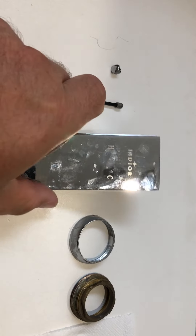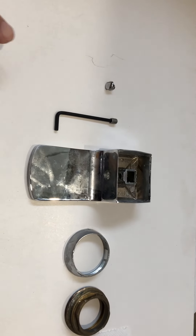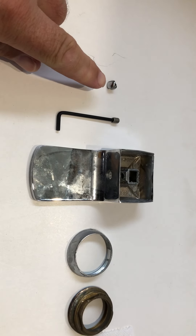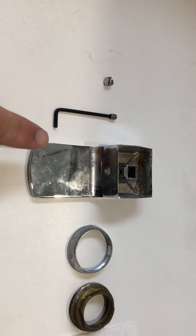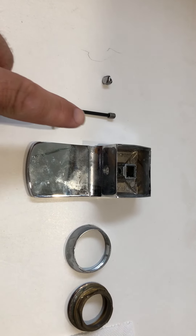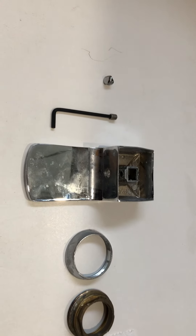So how was that done? Let's have a look here. The first step was to pluck out — with fingernails or a screwdriver — a little cap that fits in the hole there. That reveals a port where you can use a two millimeter allen key to remove the little grub screw that holds the handle in place.